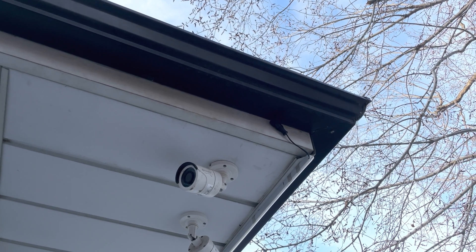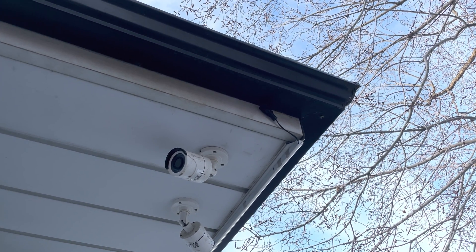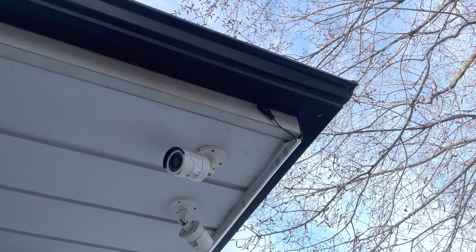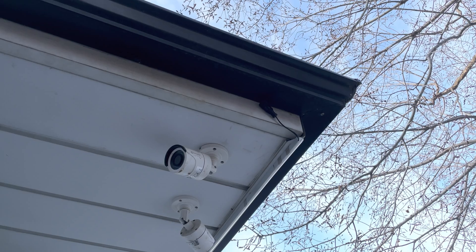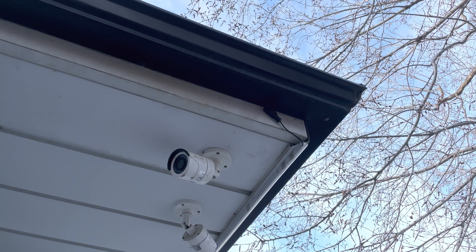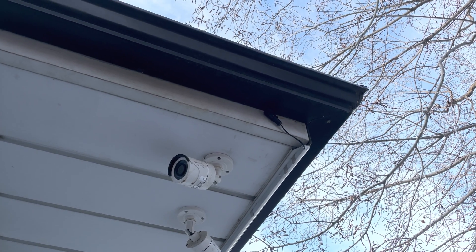This is the end of my run. My plan was actually to power inject at the end of every run, and this is the longest one which is 480 pixels, but I thought it looked fine without it so I ended up wasting a lot of time and money on power injection that I didn't end up using. The wires sitting inside and these pigtails on the end aren't being used. I just tucked them up underneath the gutter to keep them away from the elements.